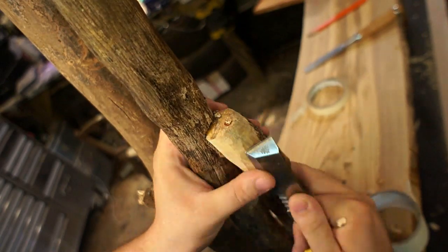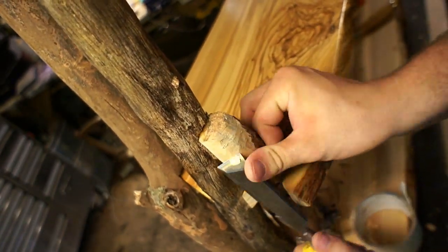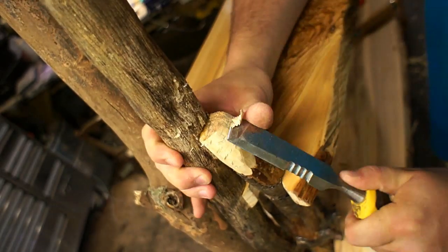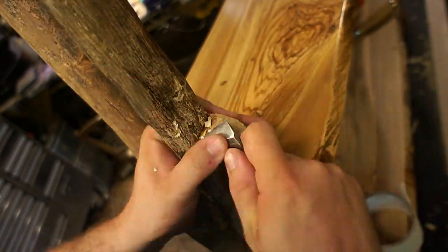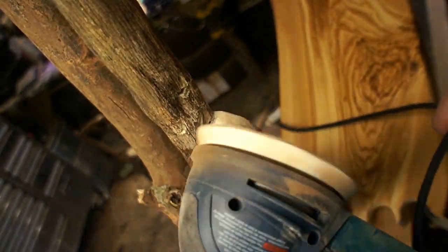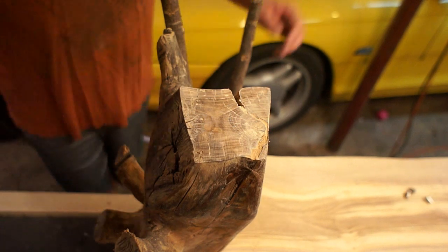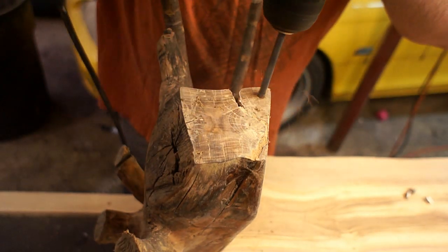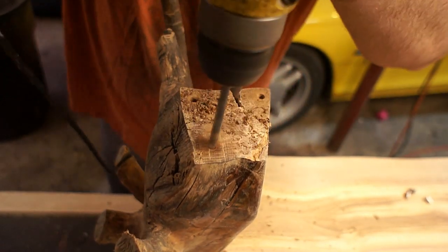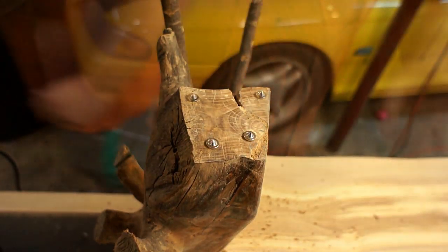A closer detail of where those two branches were interacting — the whole thing I was playing with was just how stuff was coming together naturally, trying to smooth things off and make them flow into each other. Just rounding this one off on the front. With all the joints done on the other side, I'm putting some dowel pins in this one — same process getting those centering points in there so I can transfer the points over where I need to drill up into the shelf.